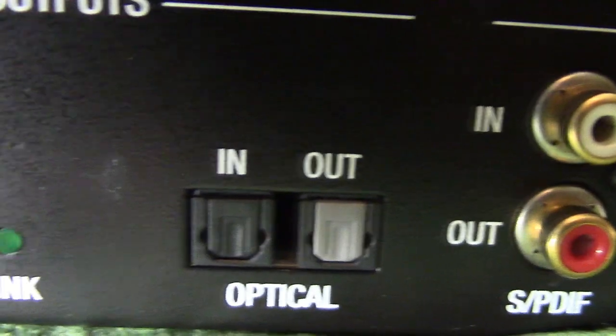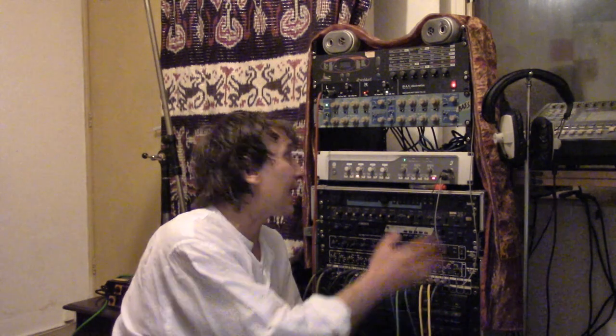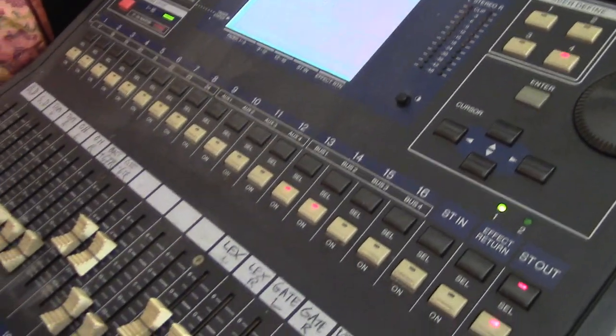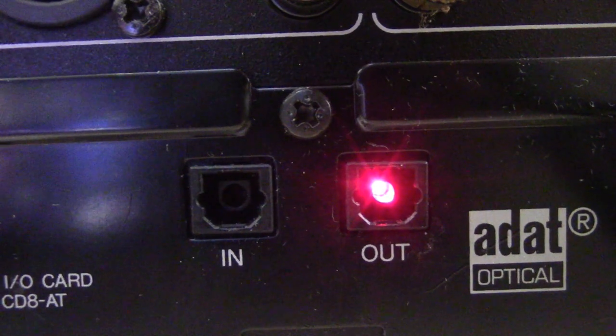Let's take a look at the digital inputs. It has an ADAT in and out socket. An ADAT connector is a fibre-optic connector that takes eight channels of audio in one connector, allowing you to connect it to any other equipment with an ADAT socket. One of my routing requirements when I bought this interface was to have the option of plugging in more mics, because the rack only has four mic inputs and I might want to record a drum kit. I've got a Yamaha O3D mixing desk with eight microphone channels and ADAT sockets, so I could connect it via ADAT and route the eight extra mic channels, giving me 12 mic channels in total.